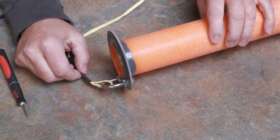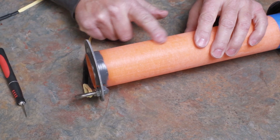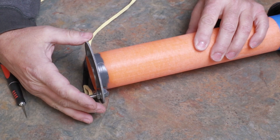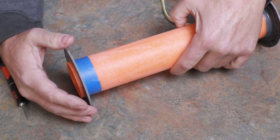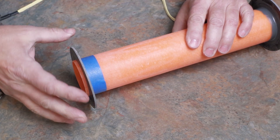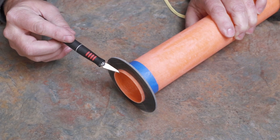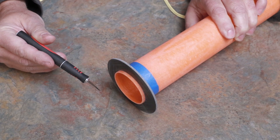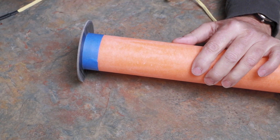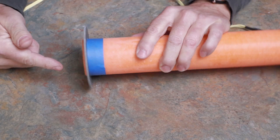The forward centering ring is complete. I made sure I put epoxy on the back of the nuts so they don't back out. One issue I found was after I sanded the motor tube so the epoxy would adhere to it, the centering ring was a little bit loose — kind of sloppy. How I fixed that was I took blue painter's tape, wrapped it around, and then ran the centering ring up over the tape. I tacked the centering ring down with super glue, let it dry, then took an exacto knife and trimmed the tape off. Now the centering ring is secure and centered in the tube as it should be. You can then come back with epoxy and finish it up.